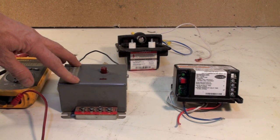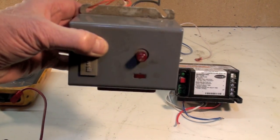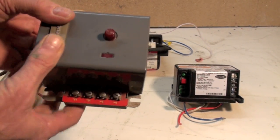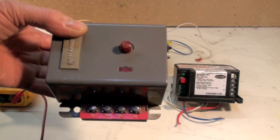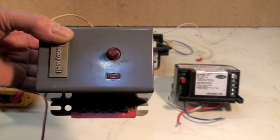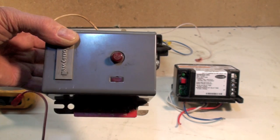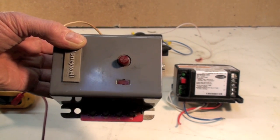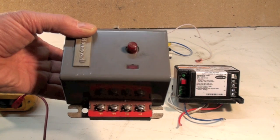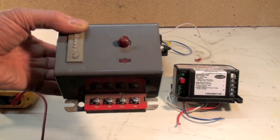Now we've got two types of controls, and both do actually the same thing. This is the old standby, the Honeywell CAD Cell Relay — very simple. This red button on the top is pressed when you have a flame failure and it will try again. It usually tries about 45 seconds. If it doesn't see the flame after the burner starts in 45 seconds, this shuts down and has to be reset with the button. It won't reset right away — it takes about three or four minutes. But it can be reset as many times as you want, which has been kind of a problem, because people keep pushing this thing and can get quite a bit of oil in that combustion chamber, which can be a real problem.